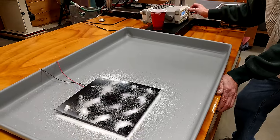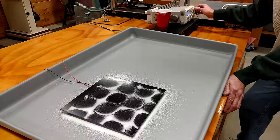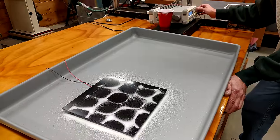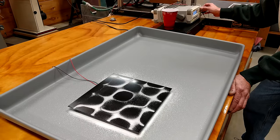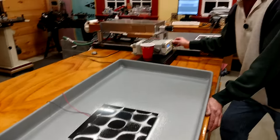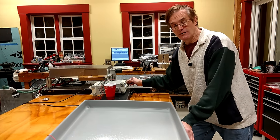Here it gets louder and the sugar begins to move. Visually, that's beautiful — but acoustically, that's lousy. Because that means you're going to get peaks in the volume coming out of the speaker at those resonance peaks, and you're not going to get the flat response you want from the panel.